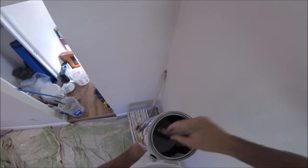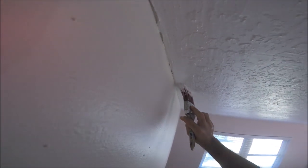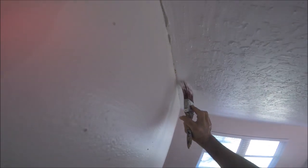Once I've done painting I'm going to drop back and create a nice straight line with caulk around the perimeter of the ceiling. I use the dab and tap method to get paint on my paintbrush. Get the bead out away from the corner and work your way in. All these little voids and gaps will disappear when I run the caulk bead.